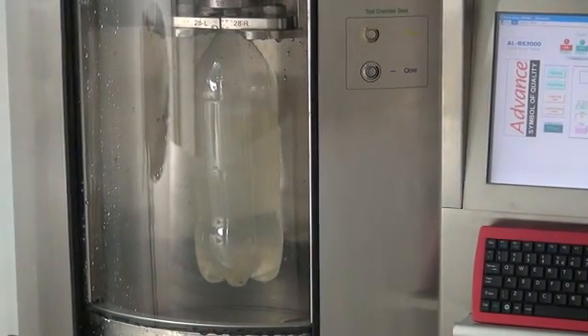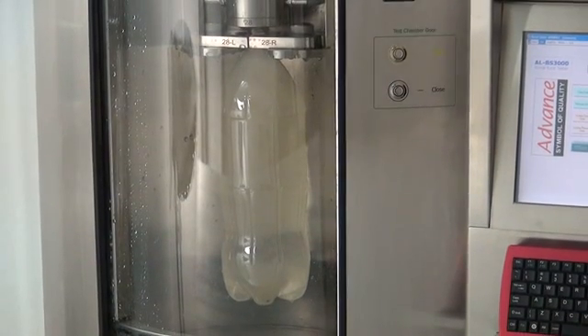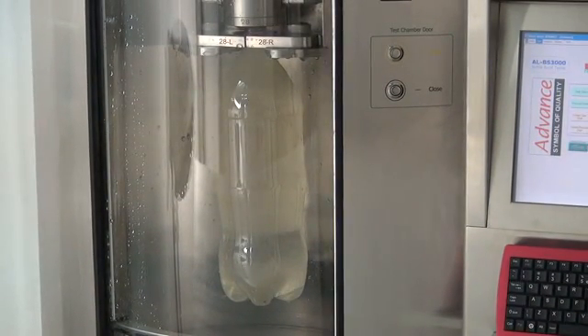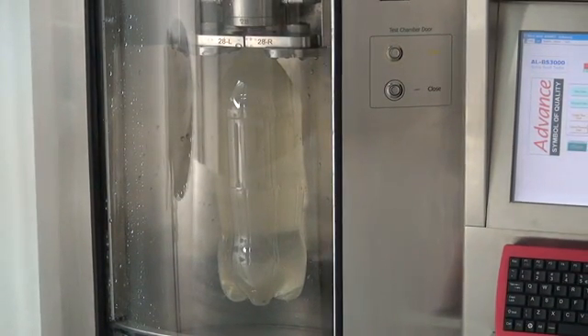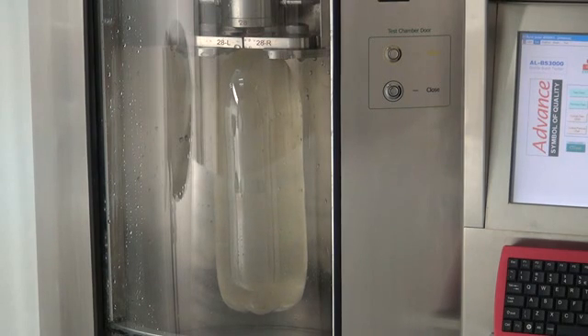This instrument makes a hydraulic and mechanical test of the bottle until its destruction, measuring different parameters such as percent of expansion volume and the breakage pressure, allowing further analysis and statistical control of the process. In addition, the tester can be set to perform time-holding resistance tests at a set pressure and time according to bottle specifications.